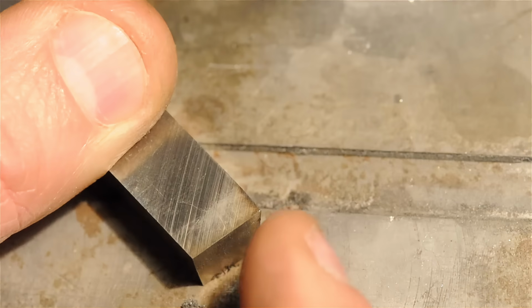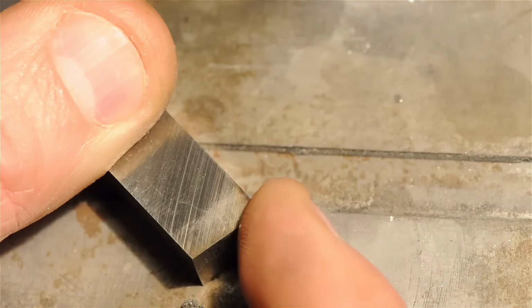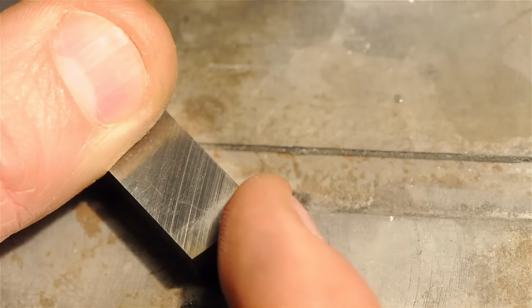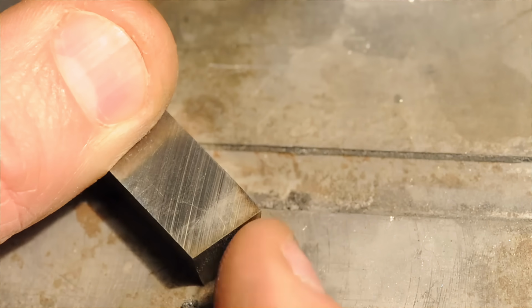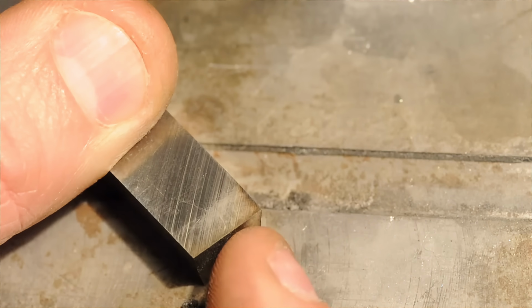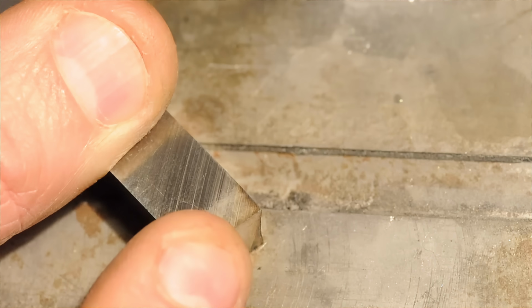Before we leave the grinder, there's just one more thing I'd like to do. Those 2 grinds have resulted in a very sharp cutting tip. Now, I was going to try this as is and show you what happened, but I'm going to bet you folks are smart enough to follow along. That tip is so sharp, it's going to leave a poor surface finish and it's not going to last very long. There's not a lot of material supporting that very small edge.